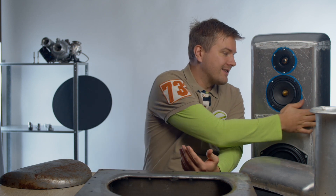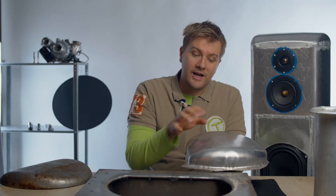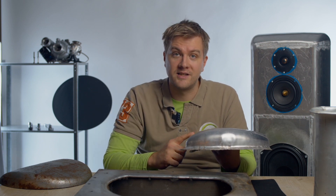I wanted to have nice shapes on the box, and that's why I designed these curvature sides. The shape of the box also affects the sound — when sound hits a sharp corner it creates diffraction waves, but if you have a smooth corner the waves travel nicely over the curves and you get better sound. On the top you can see this really nice panel. Here's one of the latest prototypes I did, and here is an interesting engineering story about the top cover of these speakers.